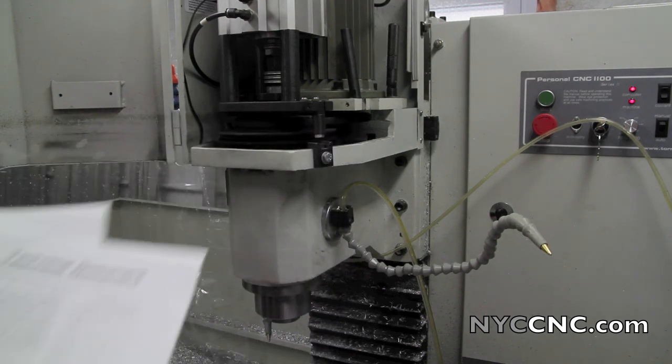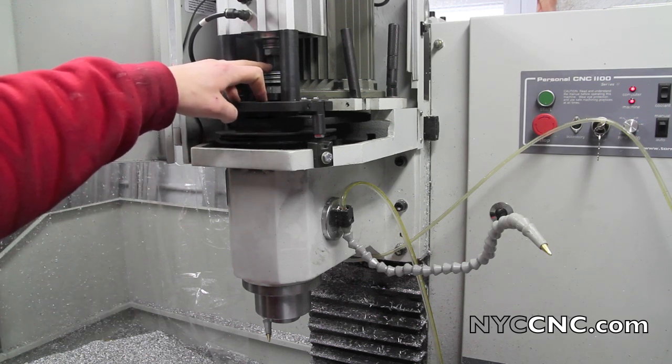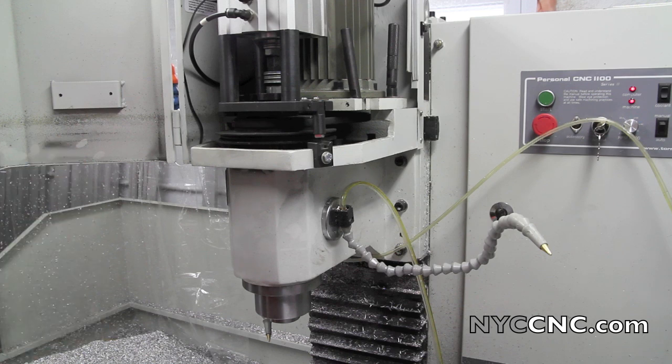It talks about the correct mechanics behind the drawbar and the Tormach tooling system, how to optimize and tweak it, and there's an appendix where they go through some testing situations on a bench press. What I wanted to show you today is I finally took a look. The reason being I was getting a snap whenever I push down on my tool changer — the tool changer ram pushes down on the drawbar — and I get a snap before that collet pops out. That was one of the symptoms described as evidence you've got friction in the wrong spot. So be ready to be appalled.